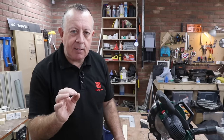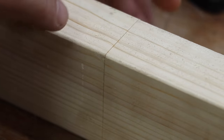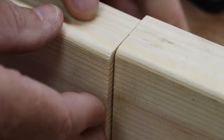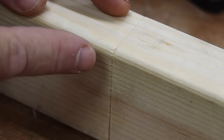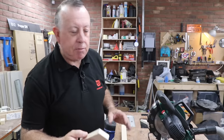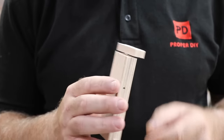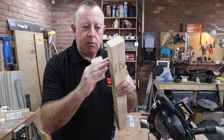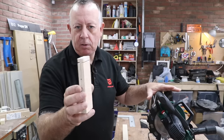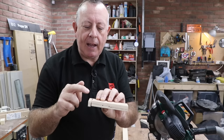I don't know what sort of blade is on it — it's a 48 tooth basic blade — but it's cutting really cleanly. Just have a look at this: this is my first cut on a piece of 3x2, and as you can see that is a really quite clean cut at the top, and even at the bottom it's absolutely bang on. I assume that's because the blade is so sharp. I've just made a cut through a piece of ply and you can see it's not quite cut all the way through because of the square corners — it's just missing that last millimetre — but there is an adjustment for this to make sure we actually cut all the way through.